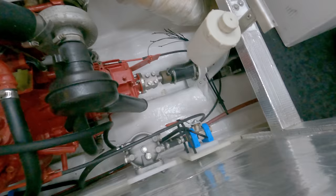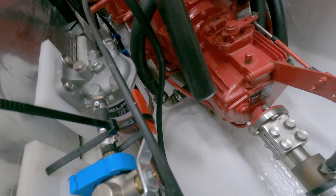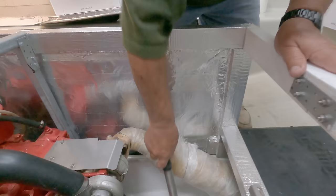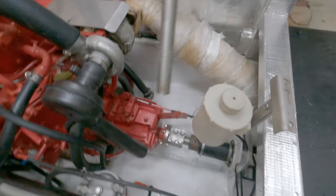We did have some final pre-trials checks, firstly to see if any leaks had appeared throughout the months of work ashore. We found a little initial leak, which we think is coming from one of the cooling hoses, which has not been adequately maintained or sealed - maybe the hose is getting a bit old as well. For the meantime, we used some hose clamps, and using the emergency tiller as a tool, we got it underneath the black pipe so water won't slosh forward.